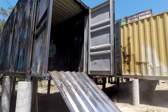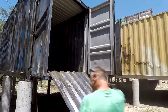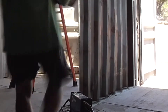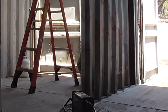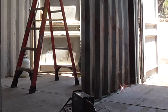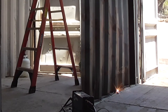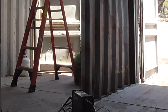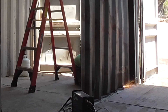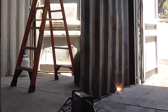Here's how you get rid of the stuff from the inside — just throw it out. Here's what it looks like cutting from the backside: it makes a mess. The plasma shoots the molten metal out of the cut, and it takes a little work because you have to do it in two directions to get the cutting head in between them. It's supposed to be flat against the material, but sometimes it was at a little angle, so it took a few extra cuts.